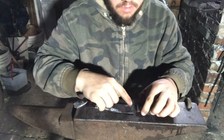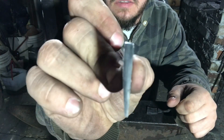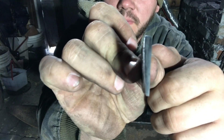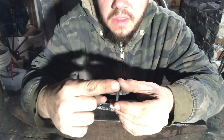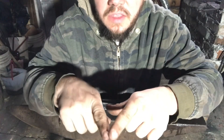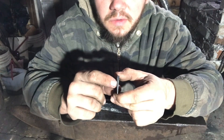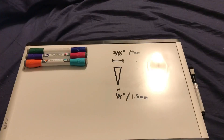It isn't till the middle of the blade that we're just starting to see some of the core. Now, why this works so well — carbon is coming in from this side, this side, this side, and this side, and this is a triangular cross section. So the case stops right in the middle and it's only getting higher carbon down to the edge.